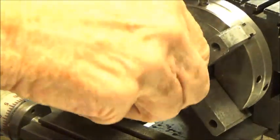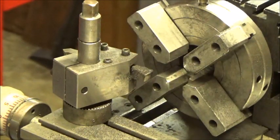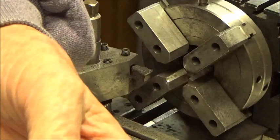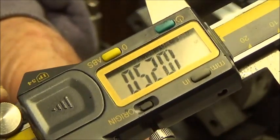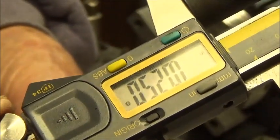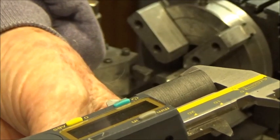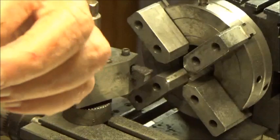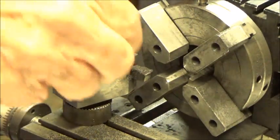At this point we're going to take it out and check the length of it. It's about 25 thousandths of an inch too long. So we're going to have to put it back in there and take off exactly 25 thousandths to get it to the right exact length. That's where we're at now, and we'll just proceed ahead to continue to cut off those 25 thousandths.